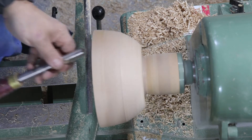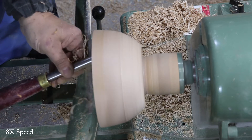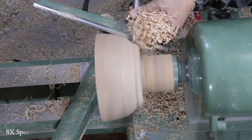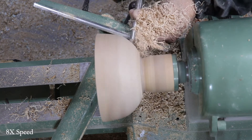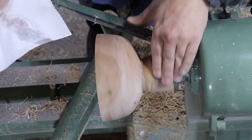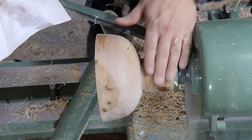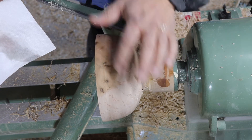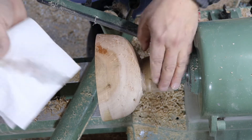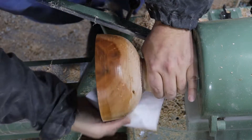I'm just going to make a quick pass around the inside and bring it up to balance, then I'll go back and finish up the outside. Just going to make a nice simple shaped bowl out of this. Now because this is a twice-turned bowl it's really hard to turn with the grain, so I'm turning against the grain, and with the scraper it's not as clean a cut as it would be with a bowl gouge. Because I know I'm going to get into a little issue right here in this heartwood — that brown spot is the heartwood center of the tree — I'm just going to put a little salad bowl oil on it to soften the grain and then get a really nice sharp scraper.